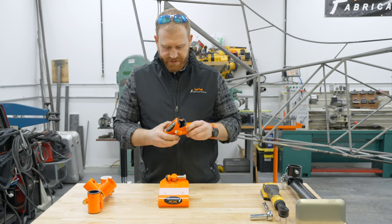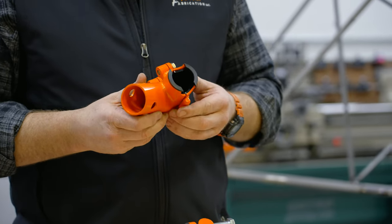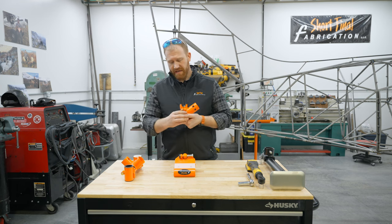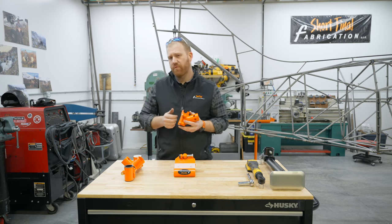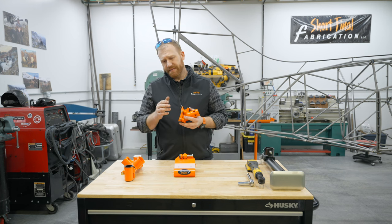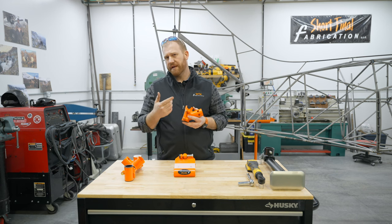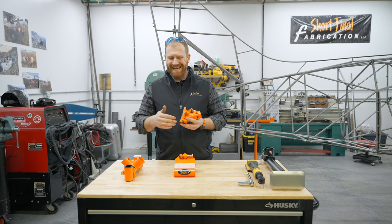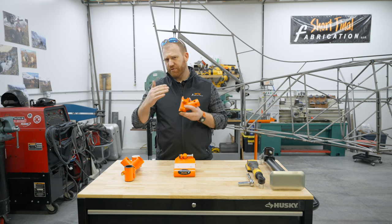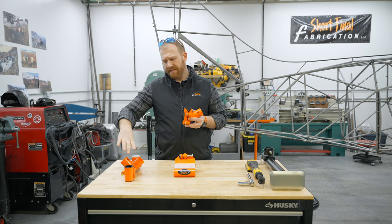The newest version is the Maul Jack. It's actually pretty compact and simple. It works a lot like the Cub jack does in that it clasps the gear. This one is designed specifically for Airframe's heavy-duty standard and 4-inch heavy-duty landing gear. The reason for that is the way the Oleo strut comes from the bottom of the gear up into the belly of the airplane and attaches to the superstructure — it would be in the way if it was designed like the Cub jack. Also, the forward and aft tubes are very close together and that angle is much more acute, so it would be harder to get it to drop in place.